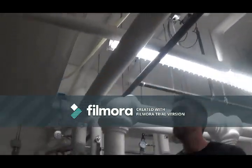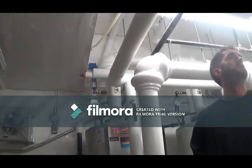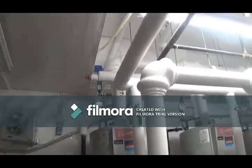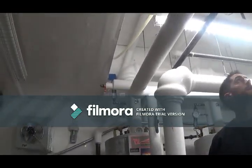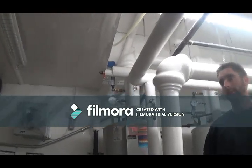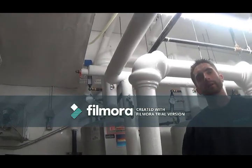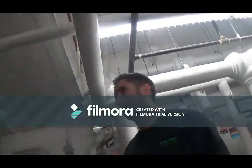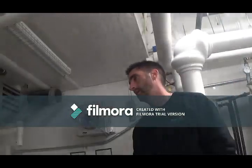During the summertime, obviously you don't want to heat up the building, because then your chiller will be working harder. But the boiler will be running 24/7 because it's also serving domestic. If you isolate the valves and the loop, no hot water will be flowing and the suites can cool down faster. Otherwise you'll get complaints from the ground floor suites that their floor is too hot. Sometimes these actuators tend to open up a little bit because the pressure pushes them open.